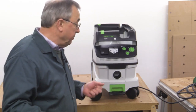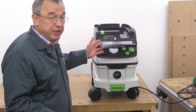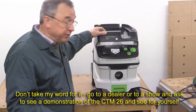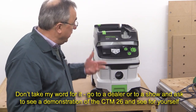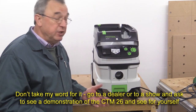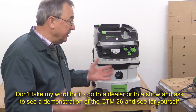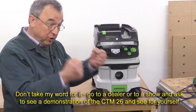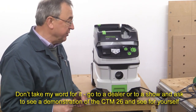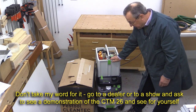Well, that's it really. I hope I've explained everything. Don't forget it's 0.1mg per cubic meter — that's the M classification. Very important now in both woodworking and construction industry in general. I hope you saw the difference when I compared the two hoses, the 27 and 36mm hose. Just in the pure capacity to suck, the 36 is far better — and that's why it's recommended for saws mainly. But also, if you've got the OF2200 router, the big router, then it's a useful thing to use there as well. Well, that's it — it's time to put it back in the box and off it will go to the next reviewer in the chain.